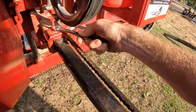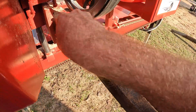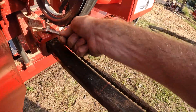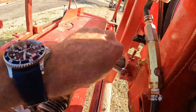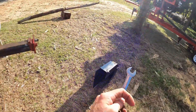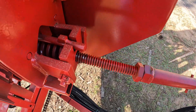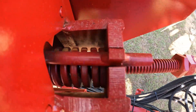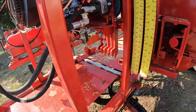Back to these jam nuts. I'll tell you what — I'm used to working with two hands, not one, so we're going a little bit slower but we'll get there. Let's put tension back on that blade and crank it up to see if we've got better movement on it. As we're doing it I'm looking for that key stock — just tension on the blade. Any time I'm doing adjustments and testing I've got to have it set at sawing tension, because if I don't I don't know if I'm making any headway or not.